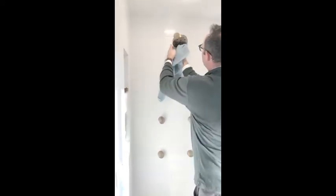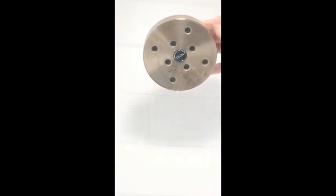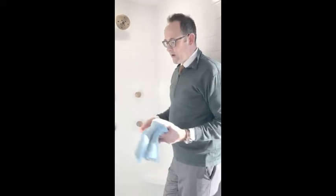I'm going to clean this head off so you can see that the shower head — Brian can shoot video of the nozzles in here — you can see how clean those all are now. Those are super clean. This morning before I stuck that vinegar on there, they were really calcified. That was just between the month we had in between cleaning. Here in Madison, and pretty much most of Wisconsin — somewhat Northern Wisconsin not as hard — but from Wausau down, really hard water. So these calcium deposits are only coming from that source, not anything wrong with your water softener.